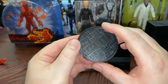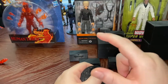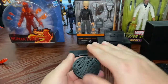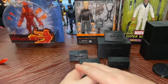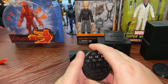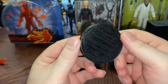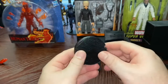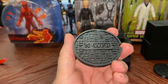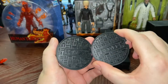The next couple of things are some 3D prints. You've seen some of the manhole covers. I had some issues — I had to replace the extruder on my FlashForge Adventure 3, replaced the removable bed because prints weren't sticking well, and changed the filament because the one I bought off Amazon may have been old or low quality. I bought a FlashForge brand filament from their store and it's been working great. I print everything on rafts, which I prefer, and as you can see the bottom quality is very good.